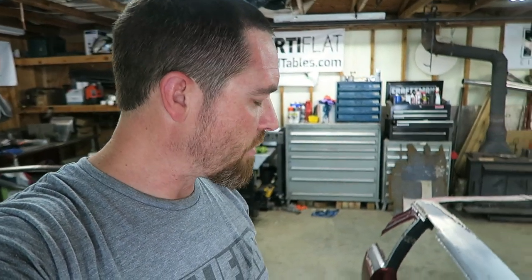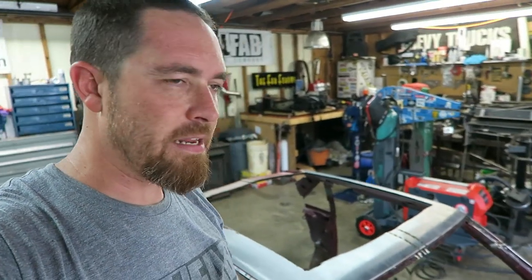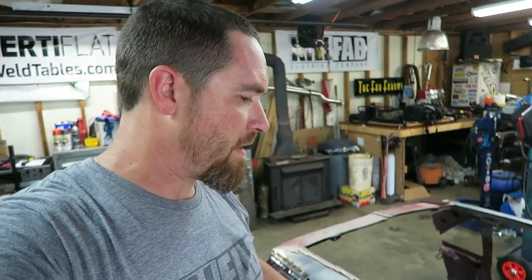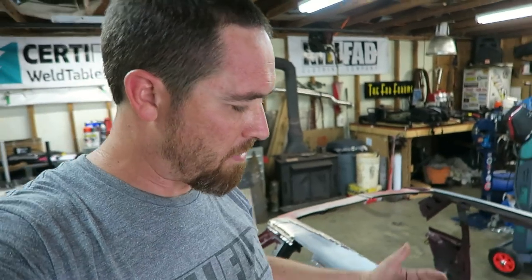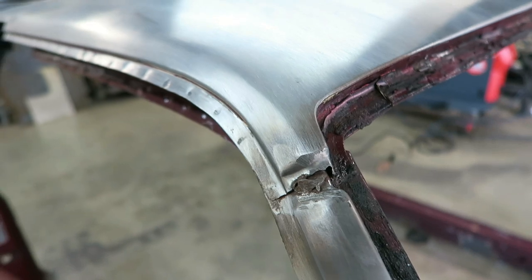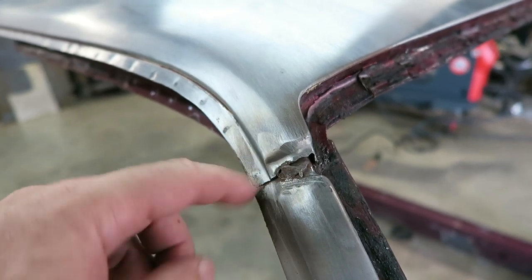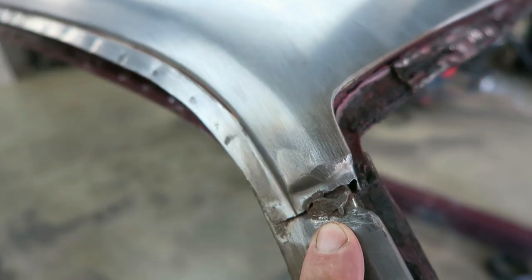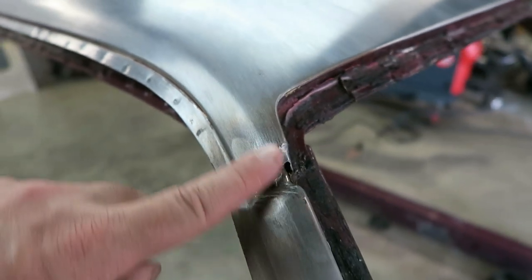And I think even on the 95s, they do it the same way, the SN95, I guess is the body style. They have these fiberglass or plastic or some kind of pieces that just pop on there. So when you pop those off, you have kind of the same deal. You can see how that body panel was formed like that, top and bottom, and then they just crudely welded it in there. And then they just fill this with lead.